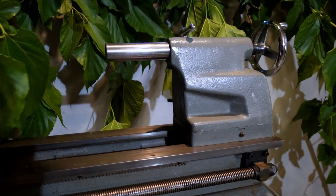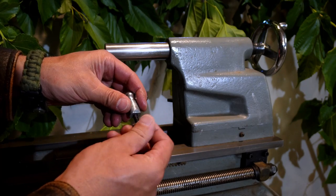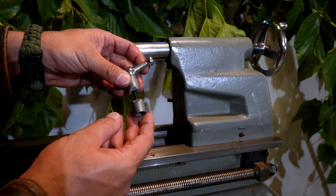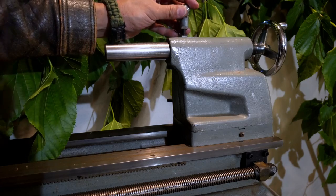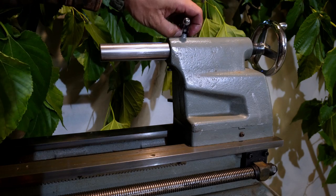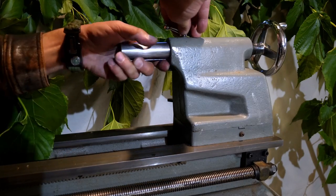It would not go in. In this lock, you can see that there are some cutouts here. And when the lock is engaged, these squeeze the spindle. It is a heck of a time getting this back in. I was in trouble. So if you do get into that situation, line up the gap, and make it barely threaded on, and then you bring this one down and kind of hold this one and push in one of the directions of the handle and slide it around, there it goes.